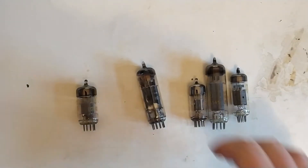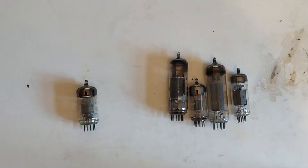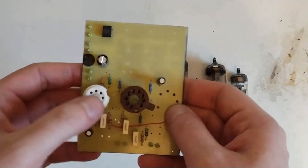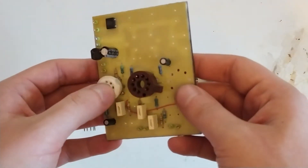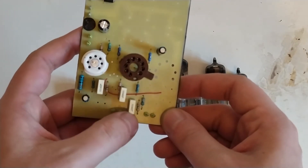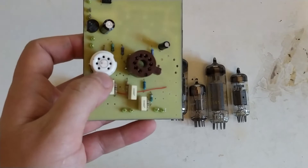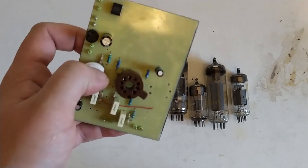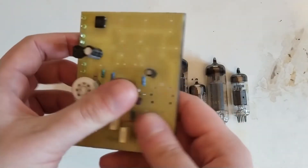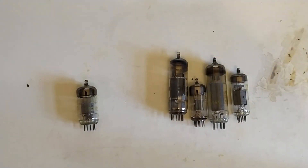So I think I want to build an amplifier that uses the PCL82. In terms of form factor, I want two boards of about this size — one that has both channels of the audio amplifier excluding the power supply, and one that has the power supply. The current board is fairly crowded and I had to make the capacitors smaller than I would have wanted, which is probably one reason why this doesn't sound as good as it could. So I'll design the power supply in the next video.